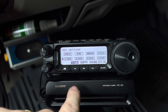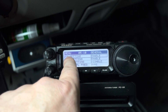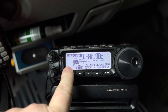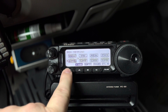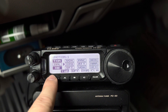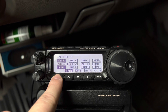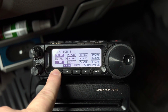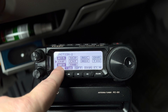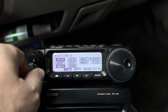You won't see this menu unless you go in with a long press. Long press to get back into the big menu if you didn't enable REC setting. Now enabling FM setting — a quick tap gets you out of that, and a quick tap gets you into the function menu, then tap to cycle through. Function menu one is where you can enable or disable intercept point optimization, which I do often use mobile, especially on 20 meters or lower — 14 megahertz and below, sometimes even on 17 meters, which is a great mobile band. Tap again for function menu two: DNF, digital notch filter, to stop heterodynes. And there's DNR, digital noise reduction.